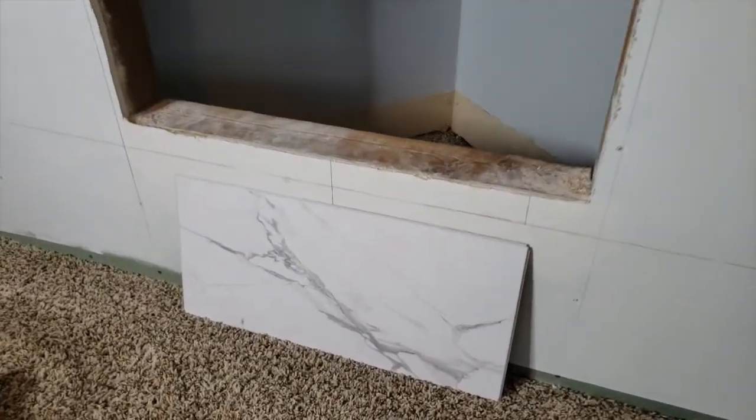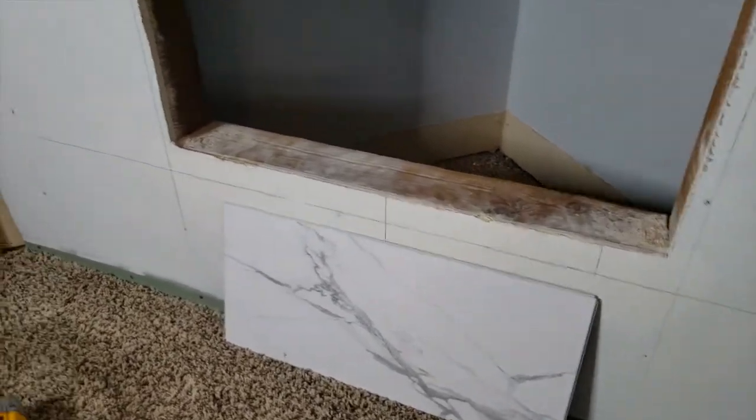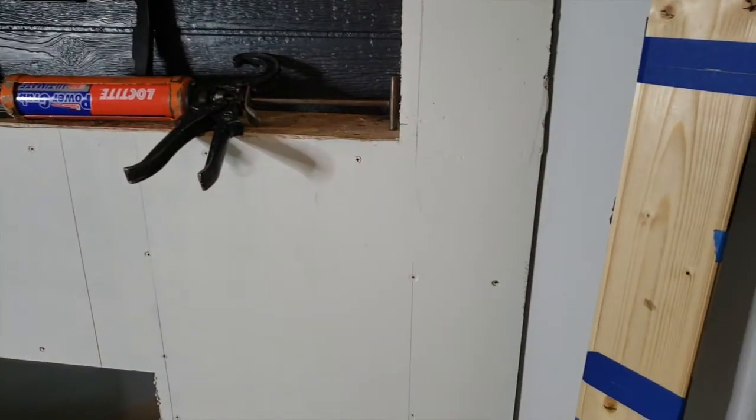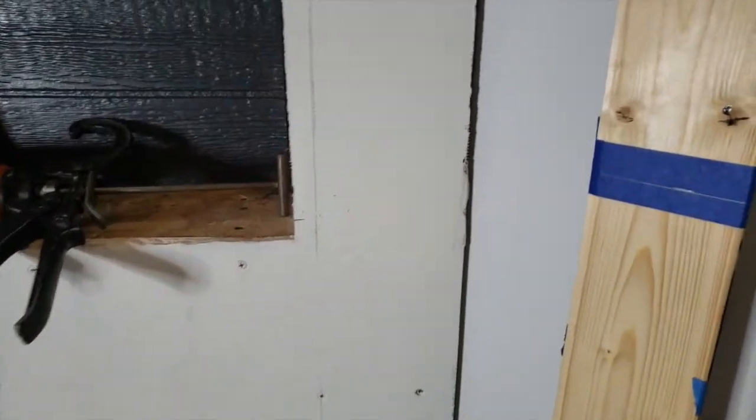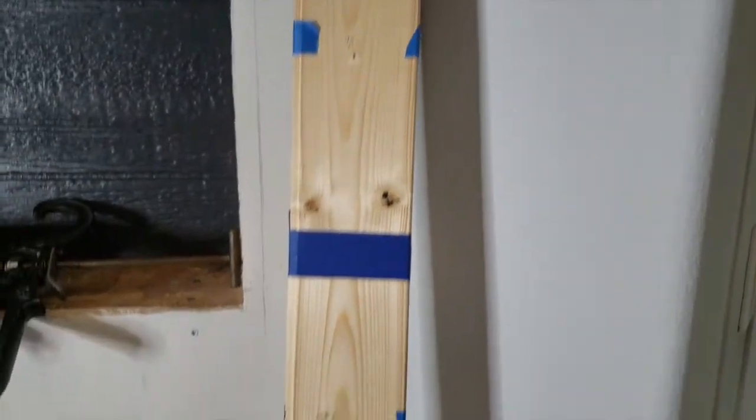So I started with a layout line. I got a level line going across there, and I got a center line that's going all the way up the center of the wall. And the tiles are 11 and an eighth inch tall when you do them horizontally. So I went ahead and laid out on a stick here. I just drew a pencil line, 11 1/8